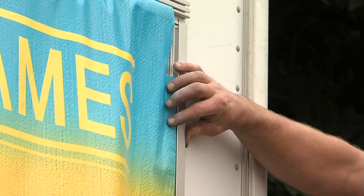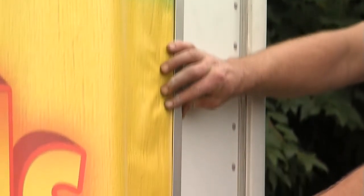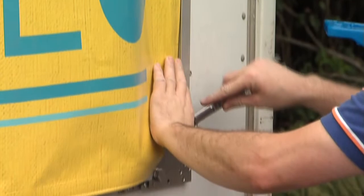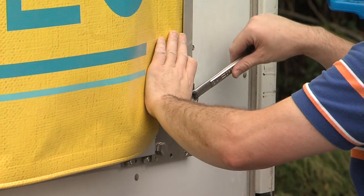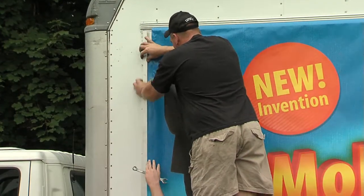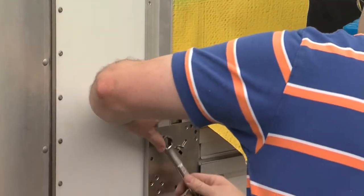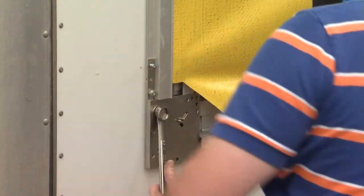Let's start inserting the flange at the right side of the banner into the banner gripper. After inserting the right flange into the banner gripper, using a ¾ inch wrench, I will turn the top knob counterclockwise until I hear a click. This grips the right side of the banner without any tension. Next, I use the same method on the left side of the banner to the left vertical frame, turning the knob on the left gearbox clockwise to capture the left flange until I hear a click.